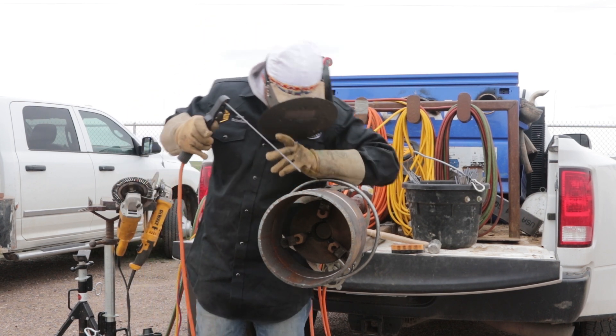Starting a half inch above the tack, making sure it's good and hot. You can see how wide that is — we're stepping now, starting to fingernail to the bevel closest to me. I'm going to take my hand over towards the other piece of pipe, away from me. It's really wanting to stick to that piece closest to me, so I'm angling in a little farther away. There's a lot of high-low in this, so we want the top of that puddle burning off square.